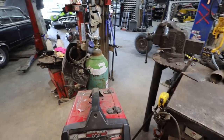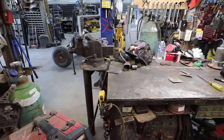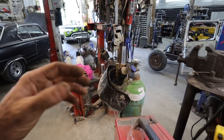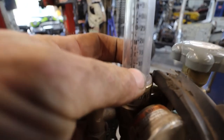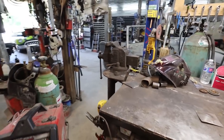Sheet metal is a different beast compared to heavy metal, but anyways we're gonna start with this one. I don't run a lot of gas — I don't have any wind or anything around, so I'm only running about 10 CFH on my gauge. My gauge shows 10, so I'm usually right around there for my gas.